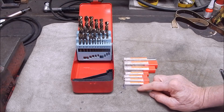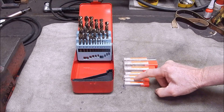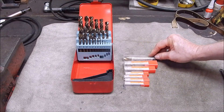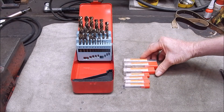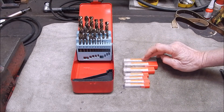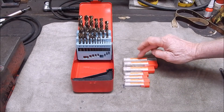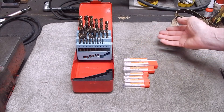So what do we have? We've got 3 to 12mm, with a 120 degree tip angle right through - but not the 12mm, which has a 90 degree tip angle. It looks like the 12mm comes with a 90 degree tip angle. These are the only spot drills that Banggood would sell, so it's obviously not a mix-up in the postal area - it's what they've actually got. So if you go for this particular size, you're going to get a 90 degree.